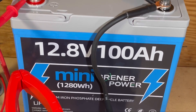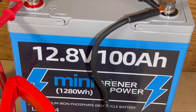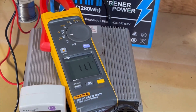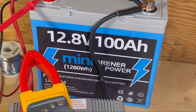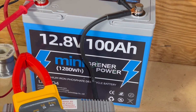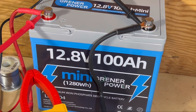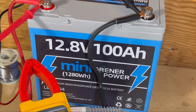The magic number we were looking for was 1.280 kilowatt-hours, and we got right around 1.2 — so 1,200 watt-hours out of this battery on a decent load of around 500 watts. Excellent battery. Only time will tell how long it will last, but it was holding 12.8 volts for a long time — almost an entire kilowatt of power.